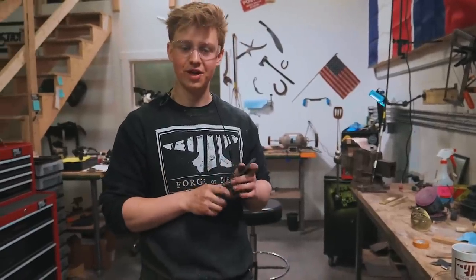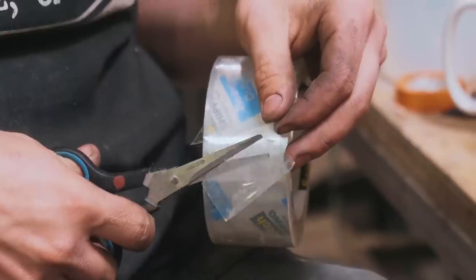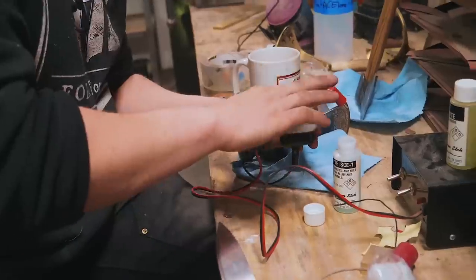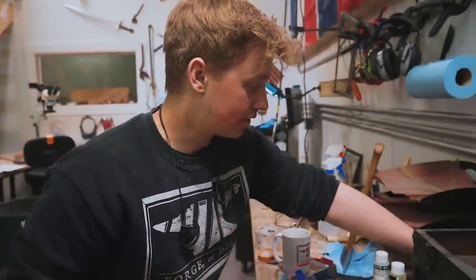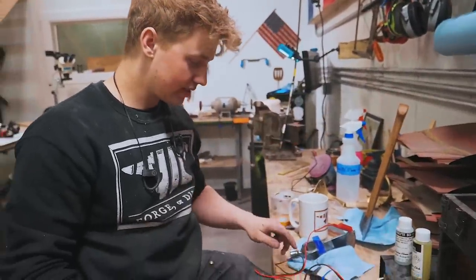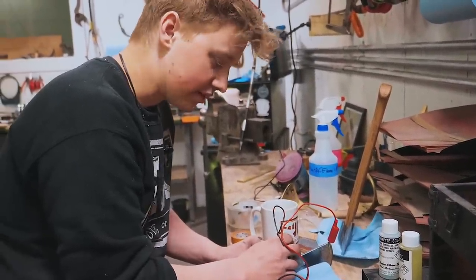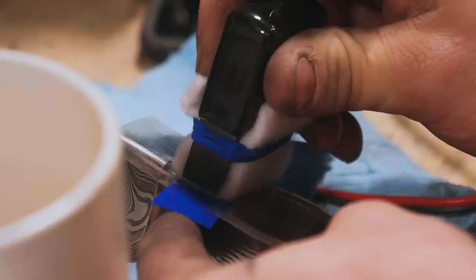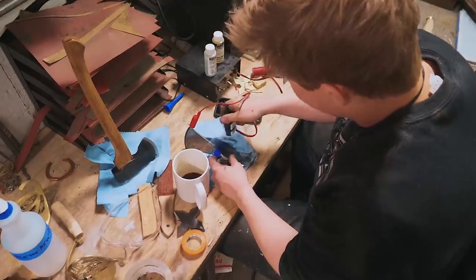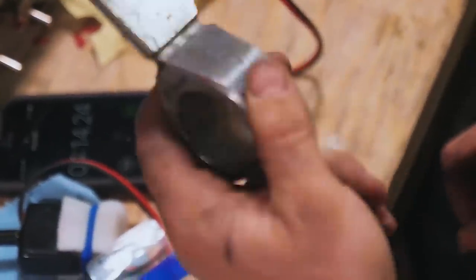After the buffing, it will be into the instant coffee etching to completely darken up the blade — to make the 1080 really dark black, and then the 15N20 will stay nice and polished. After that, it's on the handle and it's finished — ready for some throwing. We'll place the stencil and get it grounded. Now let's put chemicals on it — it's basically just a fancy saline solution, salt and water, which creates the arc between the piece and the etcher. Setting it on etch first for about two minutes, then switching to mark for another two minutes.